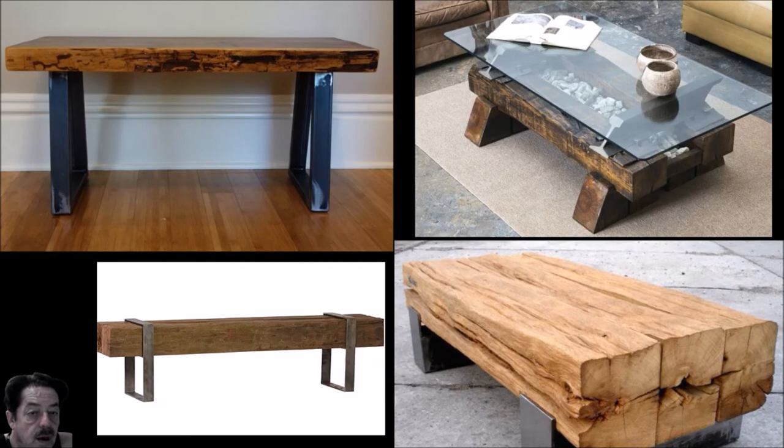On the top left, you can get tube steel and make V-patterns — the piece on the bottom makes it sit flat, and you weld flat steel across the top of the V for the table to sit on, then drill holes and use lag bolts. That one's fairly easy. The one to the right is a little harder — there's not much welding but you need real skill with a saw to cut and drop the railroad ties in like shown in the picture.